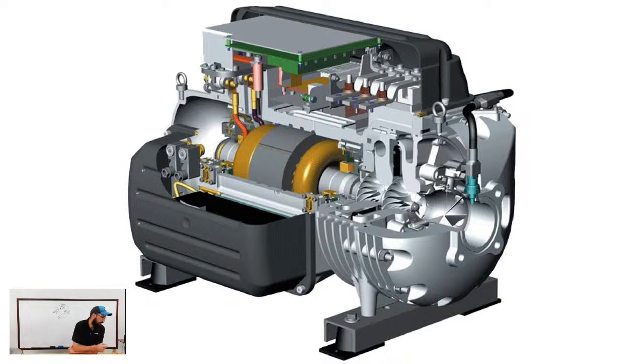How to troubleshoot a liquid load? Flooded evap. So that goes back to what type of machine. If we're talking like a York YK, for example, then its liquid level is on the condenser side, and you're going to troubleshoot that with just the sight glass. You can use the sight glass to compare what the sight glass installed on the machine is doing to what the display is showing. A lot of times the sensor will read much higher or much lower, just an extreme of one or the other compared to what the chiller is actually doing. So that's probably the easiest way with a York.